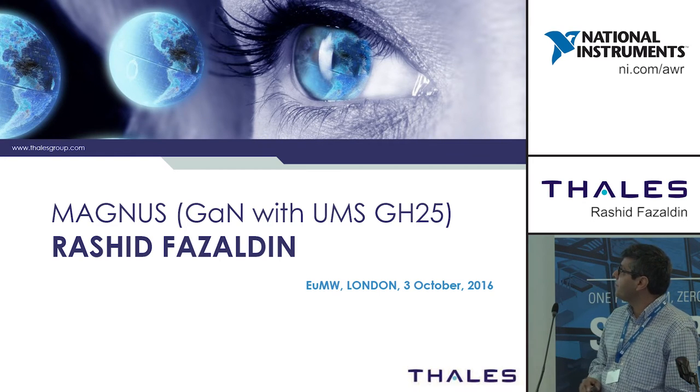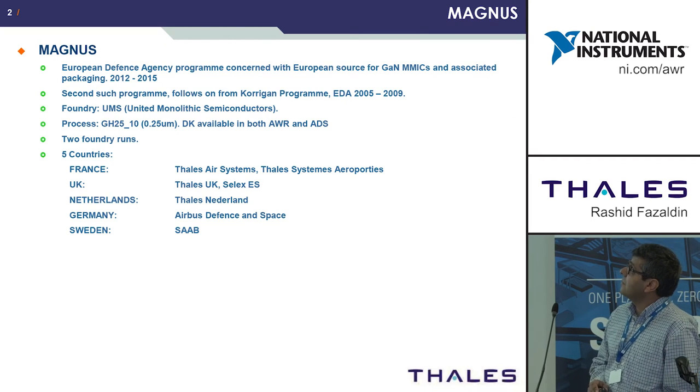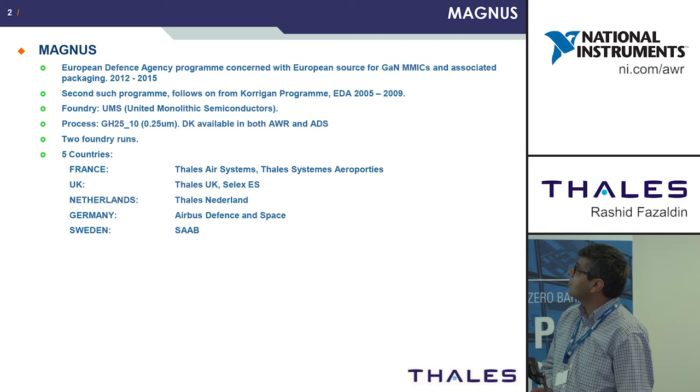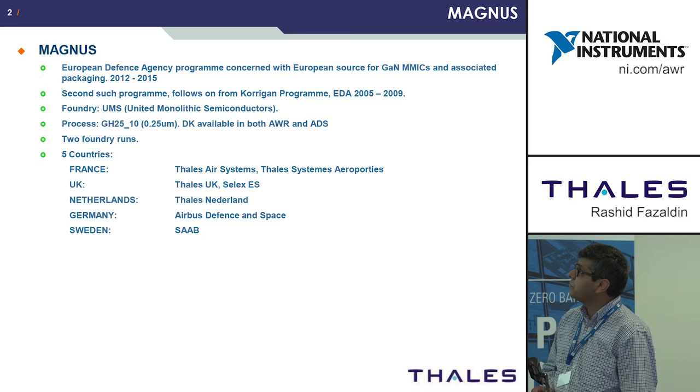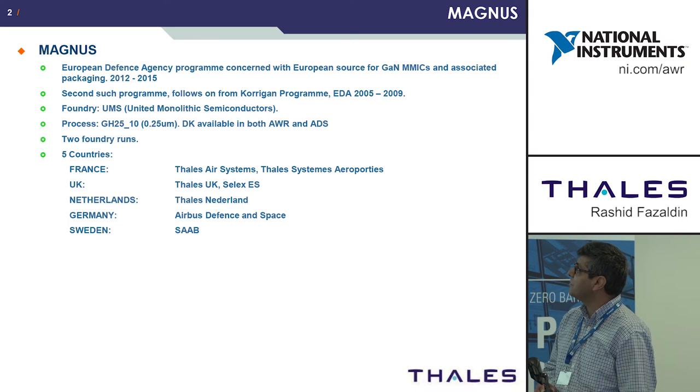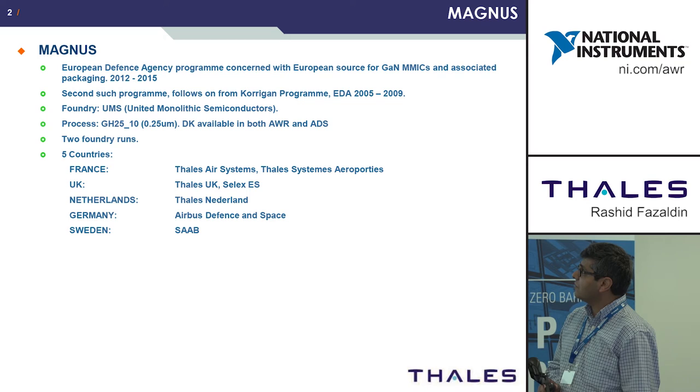I'll be sharing some results that we achieved on the Magnus program. The Magnus program was a European Defence Agency program concerned with European sourcing of GaN MMICs and associated packaging. This was a second such program following on from the Corrigan program, which ran from 2005 to 2009. The foundry used was UMS, and the process was GH25_10, a quarter micron process. The design kits were available in both AWR and ADS, and we are using AWR. We were allowed two foundry runs.